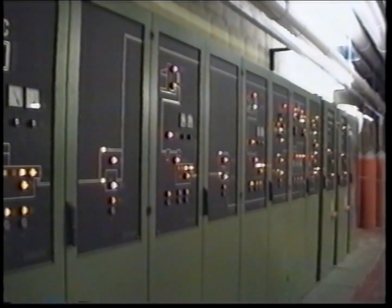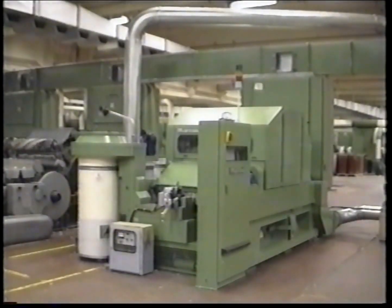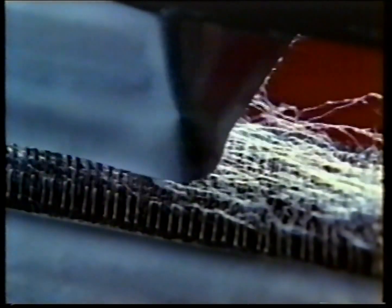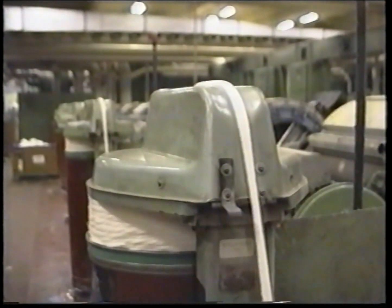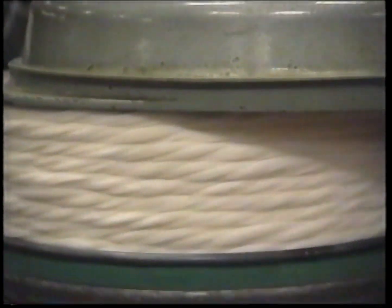The complete raw cotton preparation is controlled by a fully computerized system. The mixed and cleaned cotton is the basic material fed into the cards. Here, tiny metal pins roughly comb the cotton in order to obtain, as much as possible, parallel pulled fibers. This operation is completed in two consecutive movements. The result is a thin fleece that is pulled into a loose rope called a sliver.